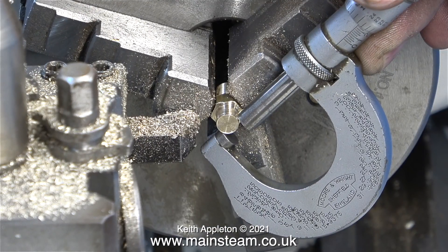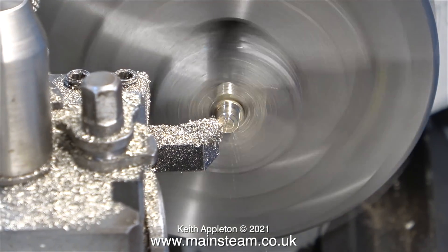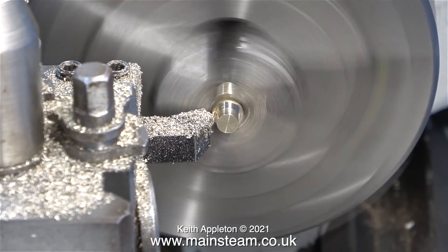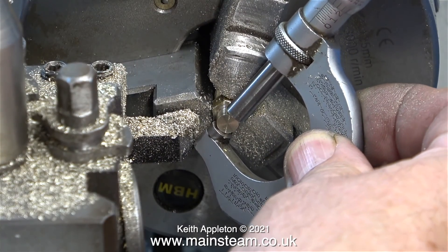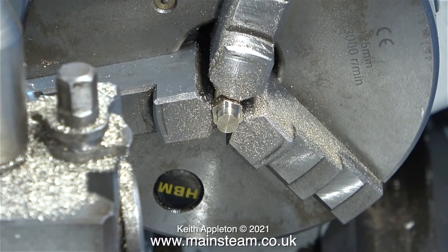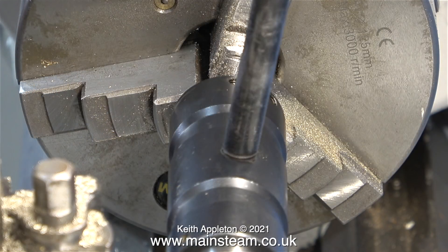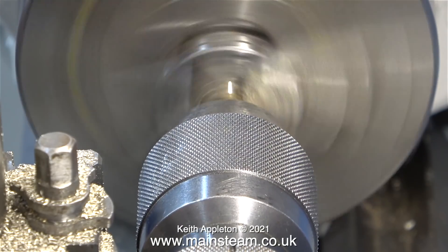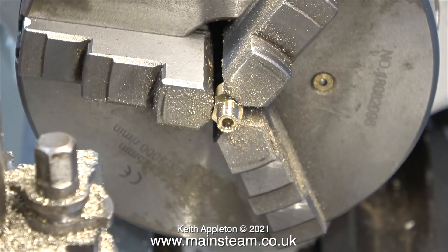This part is a thread adapter so I parted it off and turned it round in the chuck. Now it's time to cut the quarter by forty thread: face across the end first, then carefully reduce the diameter of the brass hexagon down to an exact quarter of an inch. Using my micrometer set to a quarter of an inch tells me everything's fine, so I can go ahead and remove the cutting tool and use the tailstock die holder once again, this time fitted with a quarter by forty die. Always remove cutting tools from the tool post and drills from the tailstock chuck — if you don't you will cut yourself; I speak from experience. In no time at all I have a perfect forty threads-per-inch thread. Initially I didn't drill the hole deep enough, but now there's a hole all the way through and the part is finished.